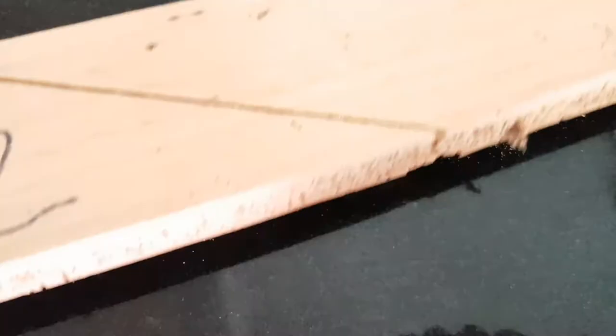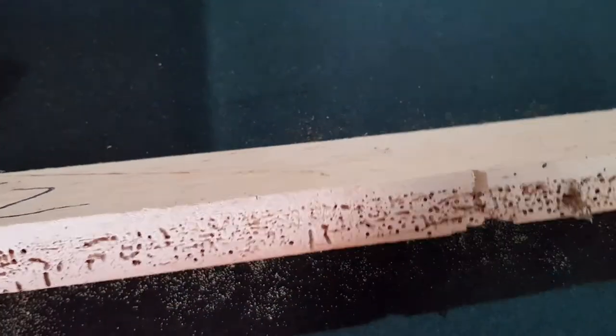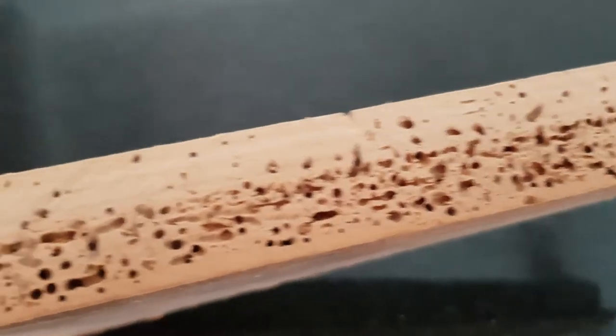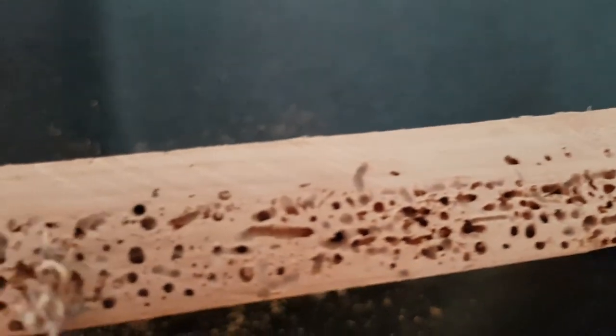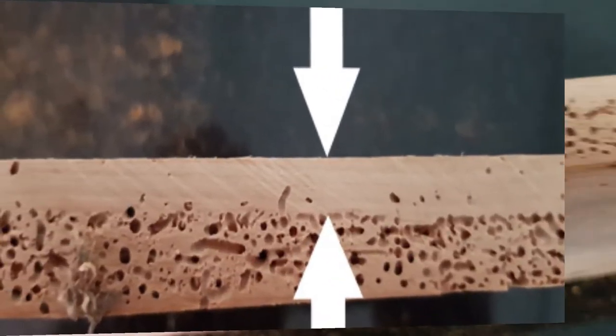This next board is another one removed from the same floor. It shows how borer damage will vary from floorboard to floorboard. This one was also test sanded, although the top surface still looked quite okay — it was showing only minor borer tracks. The side profile shows that in most cases borers leave a little timber intact on the top surface, although you will still see those tiny holes on the underside.